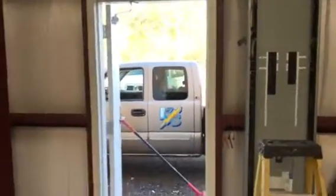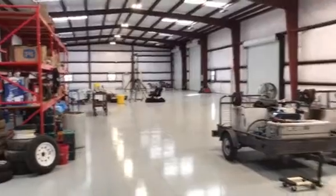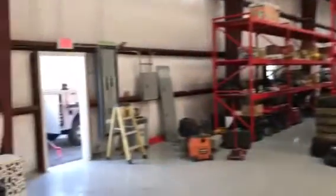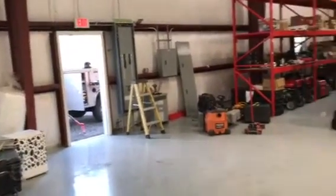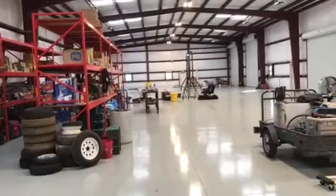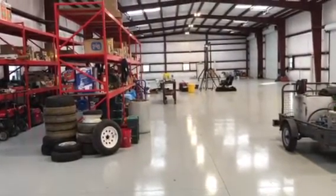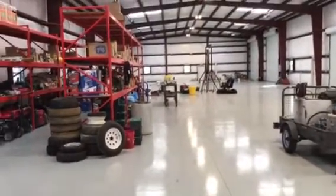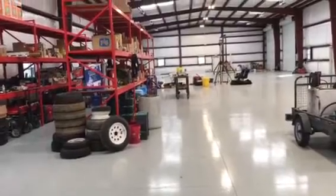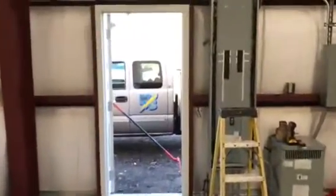Let me get off this ladder and explain the reason why we went with wireless. This is a very big warehouse — 200 by 65 feet, I believe. We've got six switches at each location: six at that door, six 200 feet away, six at this door, and six right here next to the panel. If you were doing this conventionally, you'd have to run conduit — more than likely a couple of three-quarter conduits, maybe a one-inch. They wanted all six separate switches to be three-way, so from any door you come in, you can turn on each section of lighting. It's split into six sections, and three-way switches require three wires plus a ground to each one — so there'd be a lot of wiring. So we're going wireless. I'm just going to mount those aluminum plates to the side of each door.